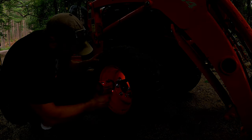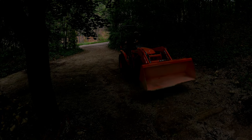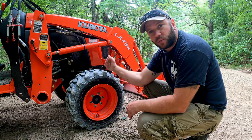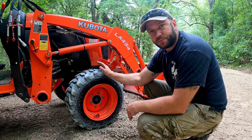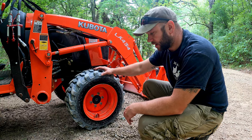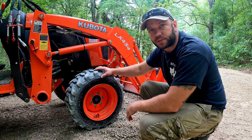I did have the intention of putting the tube in the same day, but unfortunately some weather rolled in — we ended up with a big storm. So I left the tire the way it was, got it on the tractor, and put the tractor away out of the weather. It's a week later: the storm blew through and the tire was holding enough air where I could make it work, just had to keep refilling it. I decided to run it because I'd just ordered a new tire and it's going to be a little while to come in. I did some driveway grading — same driveway where it originally popped — but it didn't hold, popped the bead, and air went out. So I'm going to take this off now and throw a tube in it so I can hopefully get this driveway graded.